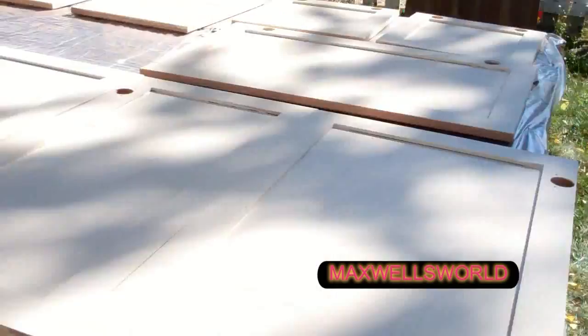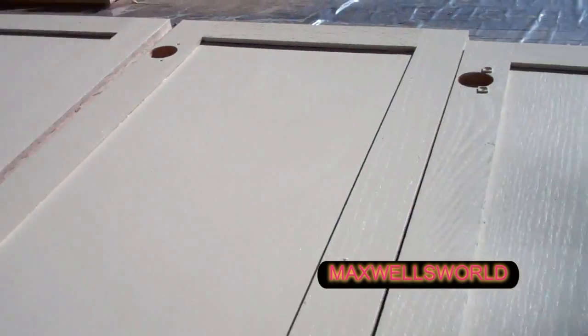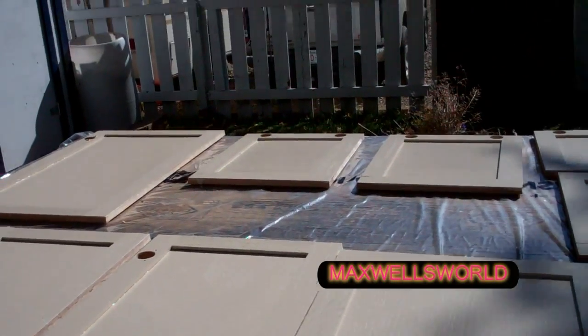Well guys, got one coat on the doors, on the back side of course. She went fairly well. I do see some fuzzies that I gotta touch and sand out, which I was expecting when you paint wood, especially raw wood. Even though it has been sanded once already, it does sometimes bring up other little fuzzies and bugs and stuff that need to be dealt with, just to keep it looking okay. But yeah, we'll let these bake in the wonderful direct sun, and check back in a bit, give them a flip and another recoat. So let's get at her.